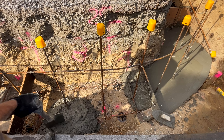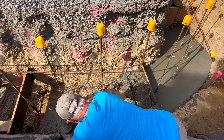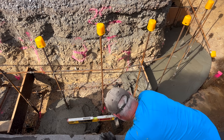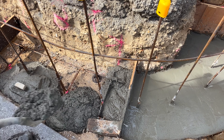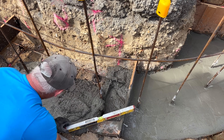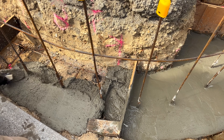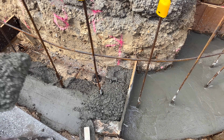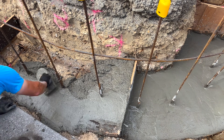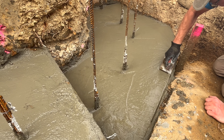I'm using a slightly stiffer mix of concrete here just to build up a guide level for the concrete in this step. I could have just knocked some pins into the ground and floated the concrete to the top of those pins, but this way I avoid any unnecessary protrusions into the concrete foundation. Using an edging tool to smooth out the edge of the concrete is not strictly necessary but it is very satisfying.